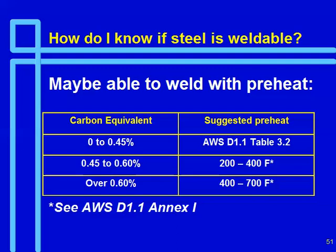Plate is a commodity item. Unless you're buying plate for bridges or plate girders specifically, you're probably buying it from a service center out of stock — plate 72 inches wide by 40 feet long. This plate could be made anywhere in the world, possibly out of old ingot-based processes from Eastern Europe or elsewhere. It'll meet ASTM requirements for A36 or A572, but may have carbon equivalents in the 40s range. Whenever I do preheats on cover plates and similar items, I usually find the plate governs the preheat requirements.